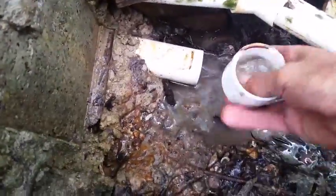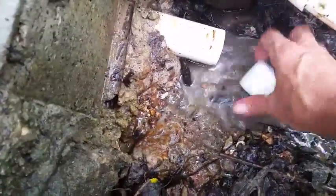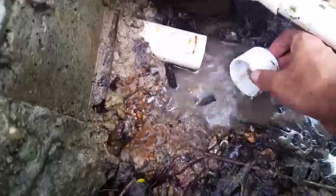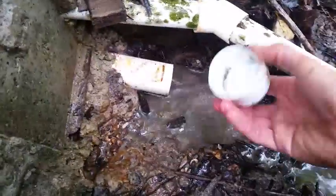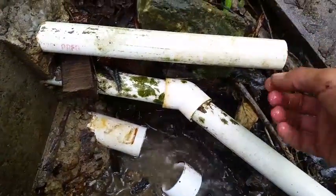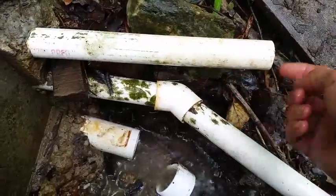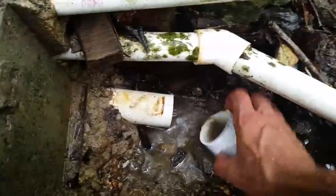So we have a lot of clay here, and clay tends to fill up in this little box, but it's never stopped operating. It's been running for, oh man, about 4 years, and I've never cleaned it out. There's even a little frog living in there, which I encourage to leave. And by the way, in your overflow pipe, it's a good idea to put some screen on the end with some tape or something, or a clamp, so that little varmints can't get into your spring box.